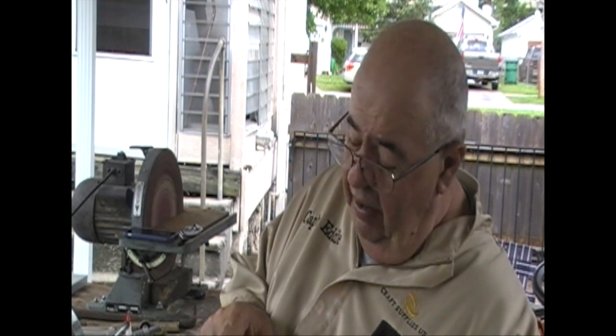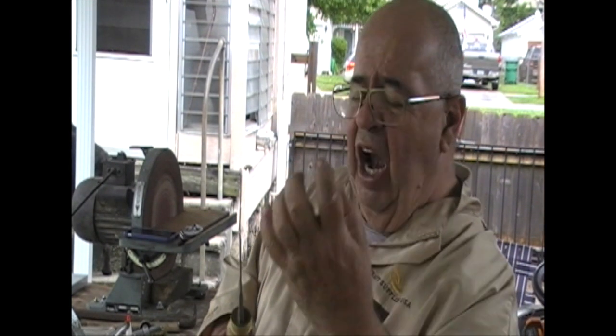Now consider this, if I bear down, thinking I'm going to remove more material and get a better cut, I'm just going to wear out my stone. So I've got it at the right spot. Now, if I put my finger on the top and come around, oh yeah. I have managed to cut and add a little burr on that shoulder. That burr is okay. I can live with that burr. I like it. It's teeth. That's a technical term. But that'll get it all done up. I don't have to redo this curve at all, ever. If I keep this coming up and keep that corner sharp, it'll be all I need for a parting tool.